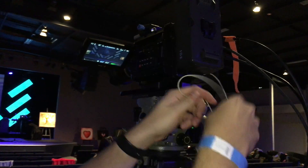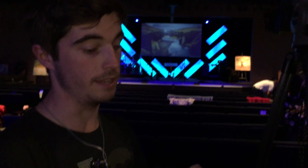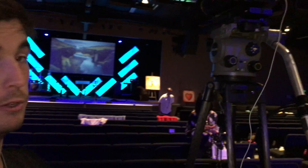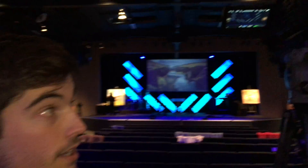The other thing I'm really impressed with is the talkback. So just using standard iPod headphones with the microphone — you can double press to talk to the cameras or the director, and single press to stop. It's all built into the switcher. We're using a Blackmagic 2ME broadcast video switcher which has the talkback function built in. So literally just plugged a line-level microphone into the input and a speaker on the output — it's been working great.